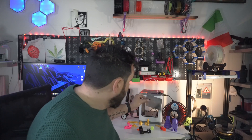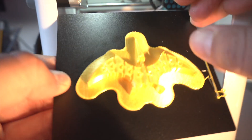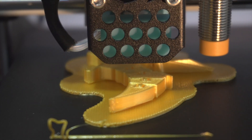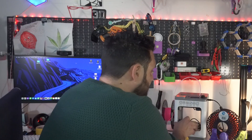What's lovely about this printer is that it has a magnetic plate that comes off and it's flexible, so the print sticks to the bed while it's hot. With a raft, when it cools it comes right off — you wash it, put it back, and it's ready for another print. Every time a print starts it does auto bed leveling, so you don't have to do it yourself. I was expecting a slower printer, but it actually prints at a decent speed, especially when I tweaked settings in Cura.